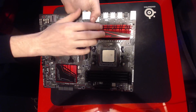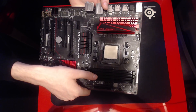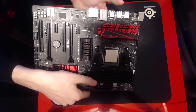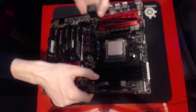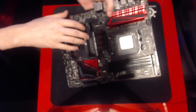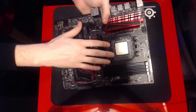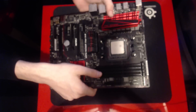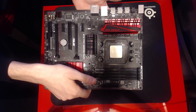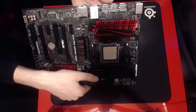This VRM — I want to do a comparison on efficiency between this and the Gigabyte board. That's going to be really hard because I'll have to match them for voltage and everything. The other thing is fewer capacitors gets you more efficiency, because big passive components all just burn power to get you better power quality. All the capacitors on the board are black, so they're all special black edition — basically it means they have 5,000-hour endurance ratings, so they'll last longer than standard 2,500-hour capacitors.